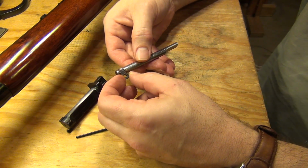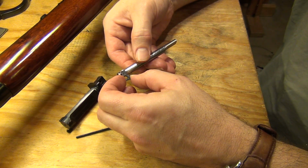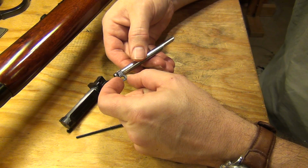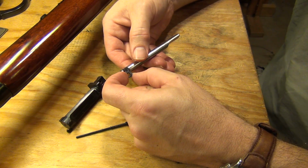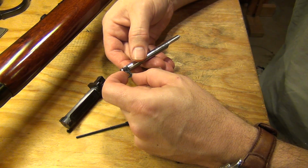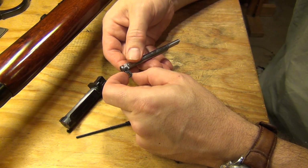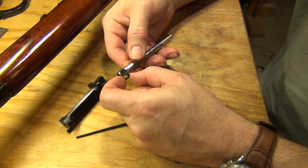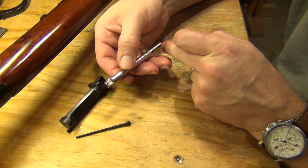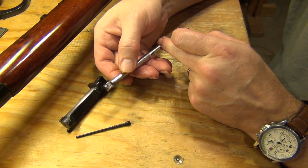so that when you levered the rifle, as you started to drop the lever and the toggle started to move, one of the things this little cam lever did was it levered the firing pin back. So what that did was the firing pin was mechanically brought to the rear, because there was no return spring or anything like that in it. So once the hammer had struck the back of the firing pin extension and driven the whole firing pin forward and touched the round off, it was stuck in the forward position.